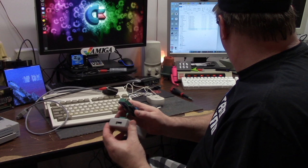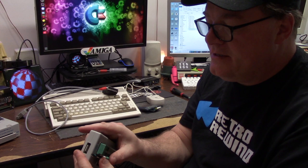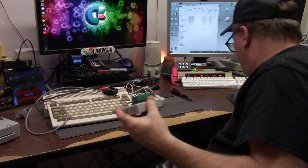XG Pro 2 with the 27C160, 322, 400, and 800 adapter. That's this guy. That black line is so I know where to put the ROM. Anyway, she goes in here like this, and this folds down. This uses USB 1 on the Type-A connector. We're going to plop that in here like so, and just let her sit.